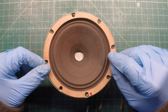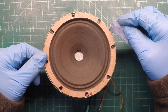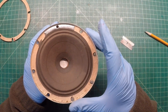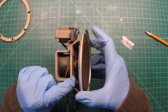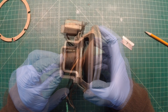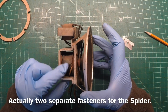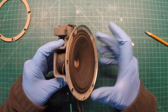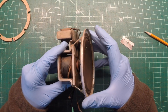I've already started releasing the gasket, going around it with a razor. I've got it loose and got the gasket out of the way. I'm a bit torn on the spider — some folks responded that it looks warped, others said it was probably from the factory this way. The speaker should come apart with just these two fasteners, which also hold the spider in place and should allow me to release the voice coil and pull the speaker cone out.